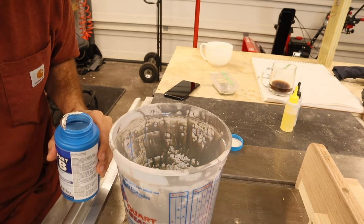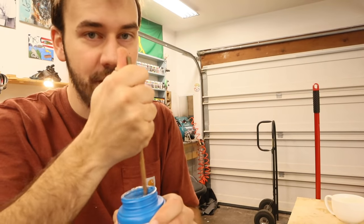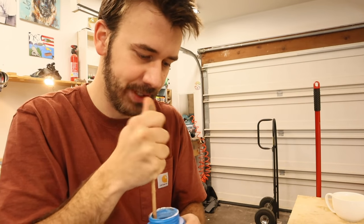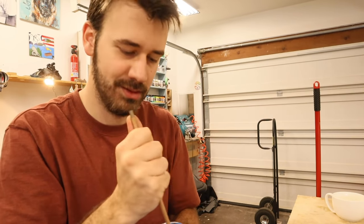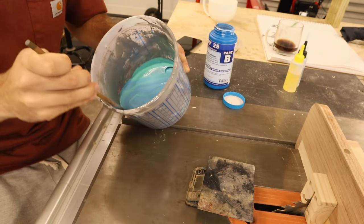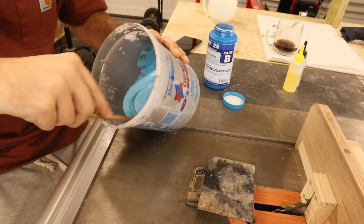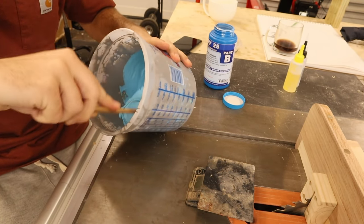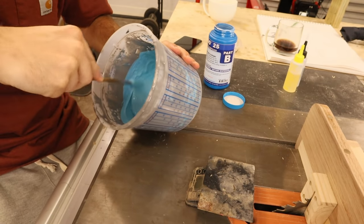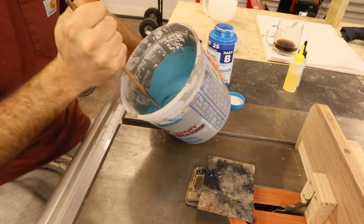It's looking like this needed stirred before I poured — at least this side looks like it needs stirred. These silicones have a shelf life, they are not good forever. This one started hard-packing and some clear stuff came to the top. Hopefully that will not affect the performance of this silicone. It's a nice thin silicone, which makes it user friendly. With thicker silicones it's a pain because you have to pour it a specific way for there not to be air pockets and more bubbles. There will always be bubbles unless you're pressure casting — we're just going to try to minimize.